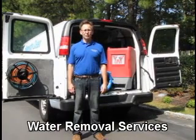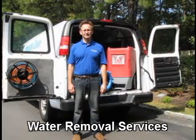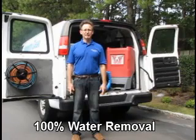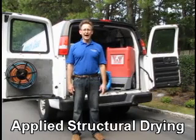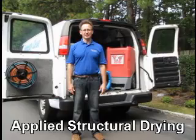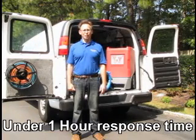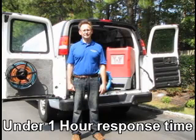What should you do when a water event happens? Your first primary concern should be safety. Therefore, you should cut off all power and electricity to the affected area. You should try to shut off or contain the water source if possible.